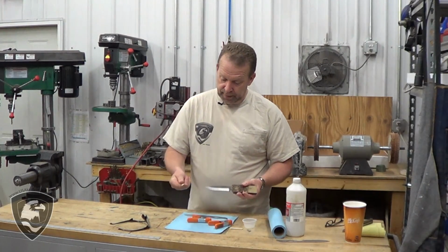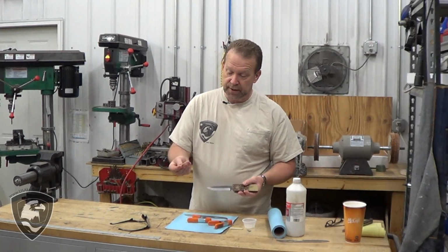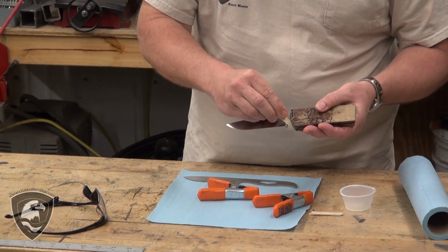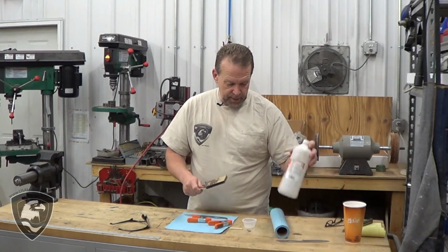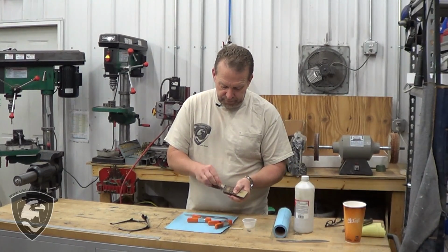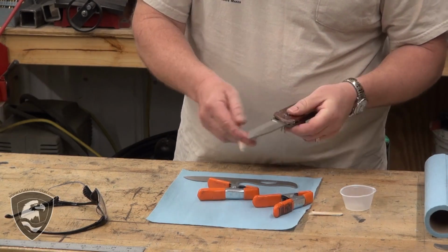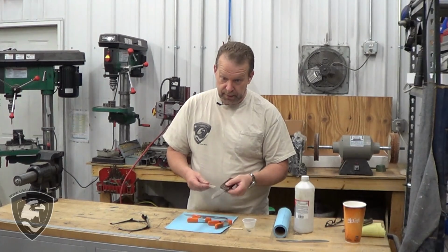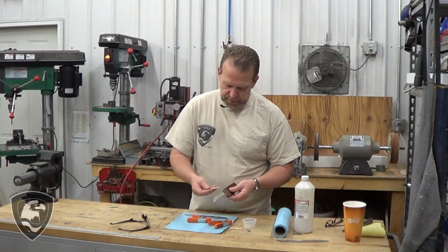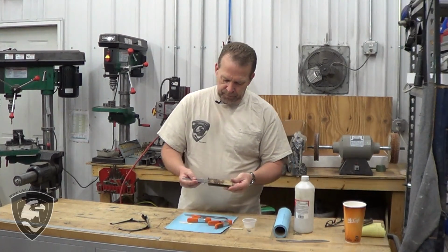When we ran out of time, as far as cleaning up, traditionally I use a craft stick, break it, get that little jagged edge there, and I'll use that as a little scraper in here, along with rubbing alcohol and some shop towels, and clean up all in front of that scale and get all that up and there. So after we shut down video yesterday, I spent another 5 minutes just cleaning up the blade all along here, using that as a scraper to get out along there, and we're ready to go on to the next step.